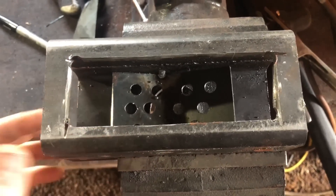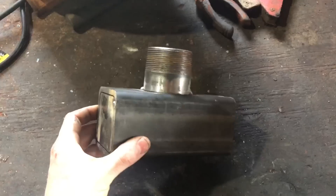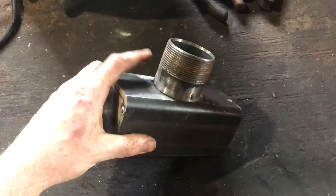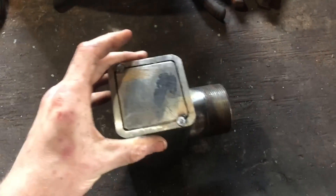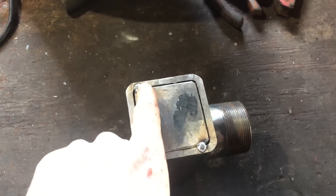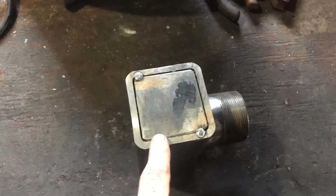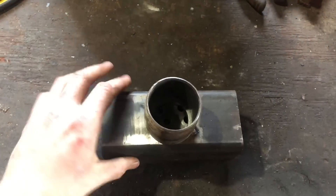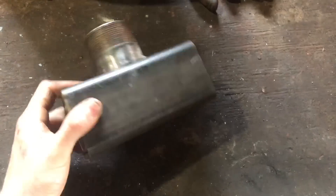The static air mixing device is welded in with just one quick tack on each side - that's all you need. Here's the burner assembly tacked together: the pipe is on top and caps are on both sides. Now we go in and run some nice big beads all the way around and fill that space in real good to make it nice and airtight, as well as all the way around here. It's a lot of welding, but we can make it happen.